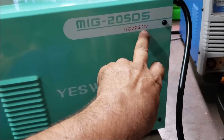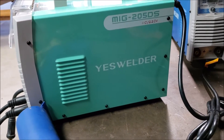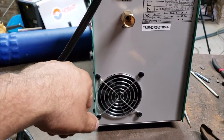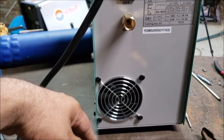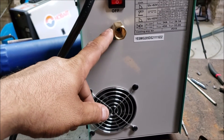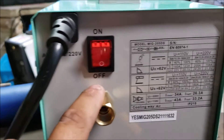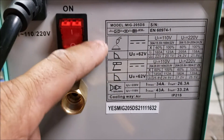Being a multi-voltage machine is nice — 110 or 220 volts. You can get more power out of the machine running on 220, and I have a 50-amp circuit to provide that power. Now the fan does get a bit loud, but it doesn't really bother me when I'm welding because I'm just hearing the stick burning or the arc basically. You got your gas inlet here — it had a loose O-ring on there, probably from testing. Went ahead and put it back. Here's your switch, and here's the diagram with all the specs for 110, 220, and the different processes.